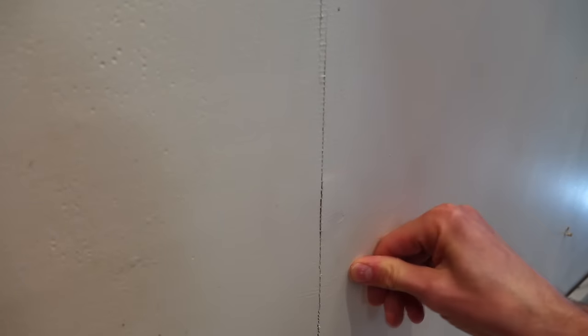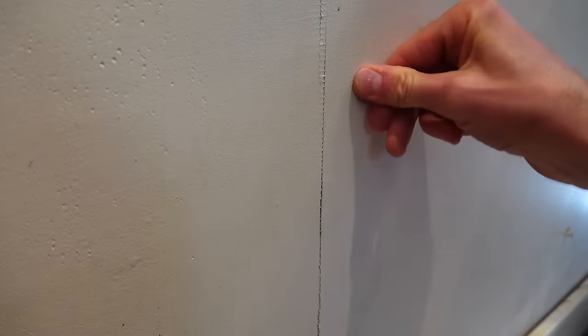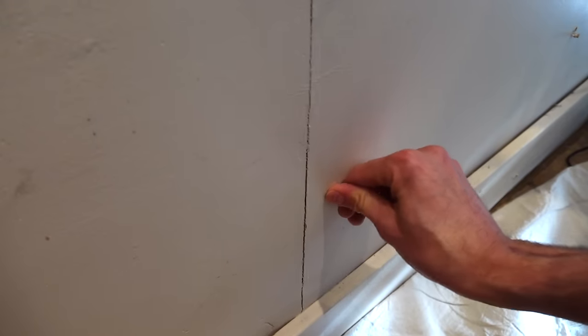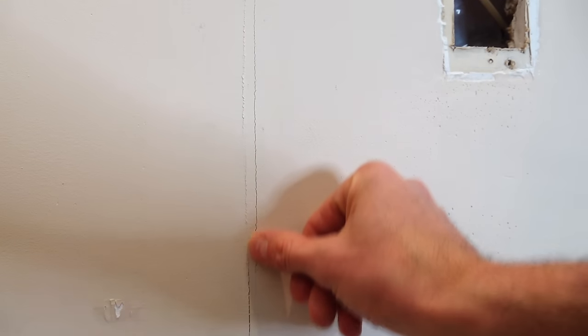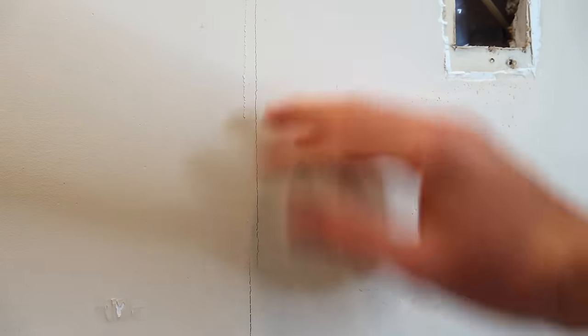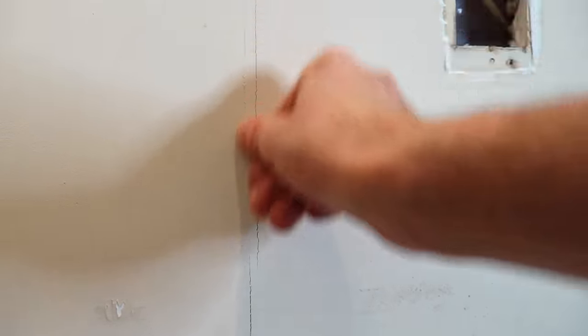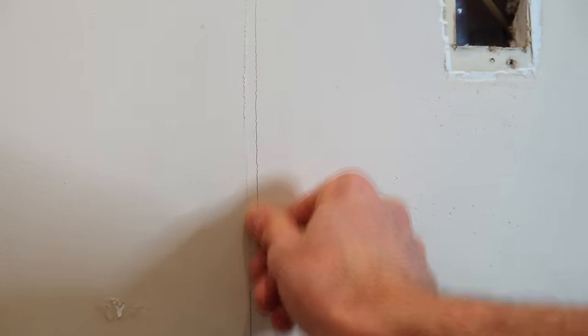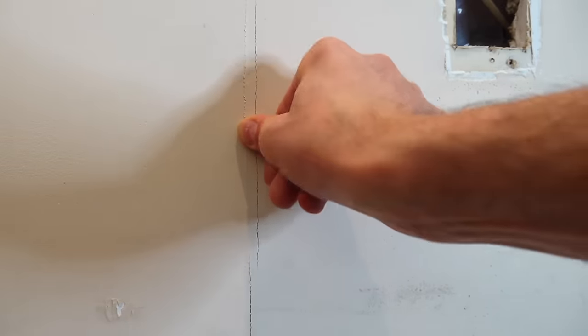The first thing that leads me to believe this is improper fastening is when I push on it I can actually move the drywall. No matter how you taped it, if the two sheets can move independently from one another it's gonna crack no matter what tape you use. One of the other things that can cause a mesh tape crack is if the joint wasn't full — maybe they just put the mesh tape on with mud and only got about an eighth of an inch in. But when I push on the mud it's not cracking and going in, so there was probably enough mud in this joint. The whole thing was just poorly fastened.